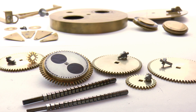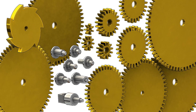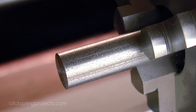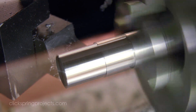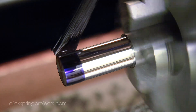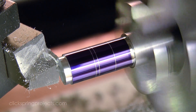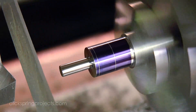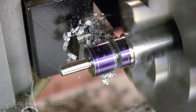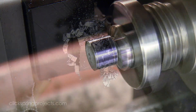So I've specified a much more straightforward approach for this modern interpretation of the machine: round shafts in round holes, bonded with either soft solder or, if you prefer, one of the modern adhesives. Mechanically this approach is enough to meet the small loads experienced in the machine, and aside from making it easier to construct, it also makes depthing more convenient. An additional benefit is that it also allows for a much less destructive disassembly, should that be required at some point in the future.